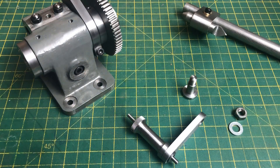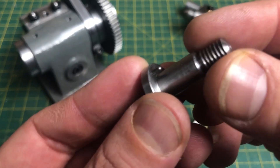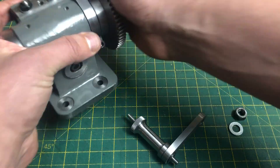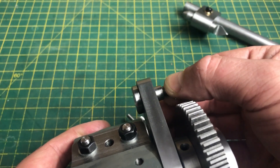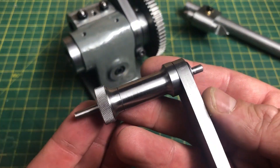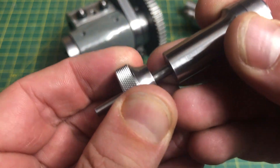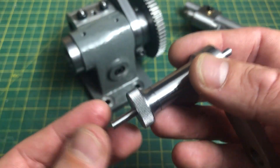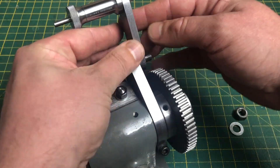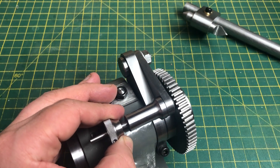The bolt looks okay. I've secured the silver steel pin there with Loctite, just cut to length and domed the ends freehand using a file on the lathe. The fit in the banjo is actually very satisfying and while that pin is probably not strictly necessary it does add a certain something. I have set the knob on the plunger to the dimensions on the plans and will adjust this length once I have the holes drilled in the gear. The plans also call for a pin inside this joint that can be used as a hold-out, which I will leave until I've settled on the final sizing. This whole assembly can now be mounted onto the body with a single M8 nut and we are getting close to having a functional dividing head.